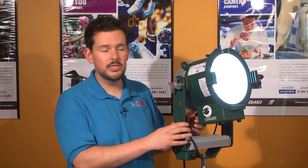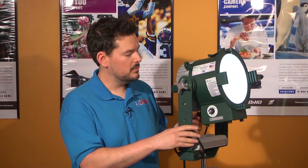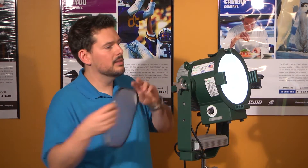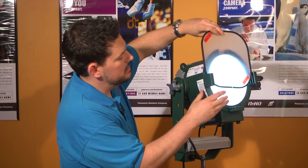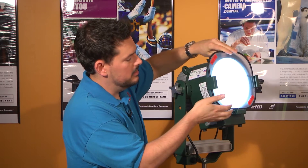The difference between this and an HMI is the fact that this is LED. And if I bring this here, I'll dim this down here, you should be able to see the LEDs in there. The LED obviously has some great advantages — and as I slide my lens in here, I'll show you those advantages — first of all, power. Your power is only 1.77 amps, so very little power draw. You can actually power the light off of a 28-volt battery as well.